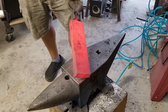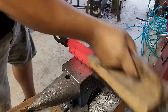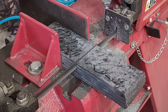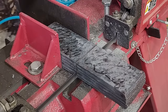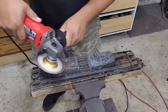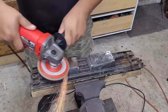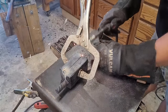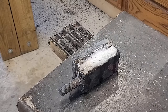Here I'm just gonna straighten it out so I get nice even pieces when I cut it, and hopefully I don't have to do too much grinding whenever I re-forge weld it. One of the newer tools I like to use is a diamond wheel — it does really quick work of the scale and makes literally no dirt or dust. It's one of my go-to tools. Then I'm gonna hit it with the flap disc to smooth out the surface and get all those spots nice and clean. Here I'm spraying some WD-40 right into the seam, and that'll help with a nice strong forge weld.